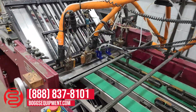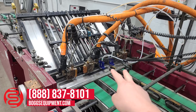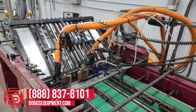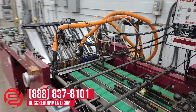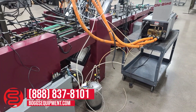Obviously you wouldn't run the job like this, but we just have it set up for showing you what's going on with the system. There's a cold glue system with the blue heads here — there are two on the machine, and there are a number of extra heads in the box. You can run up to at least four with what's here, and it's expandable from there. The cold glue system is in the back; it runs on a pressure pot and air — that's all there is to it.